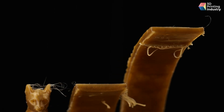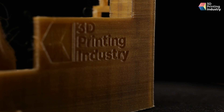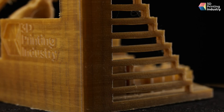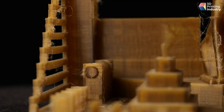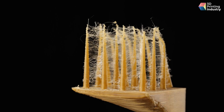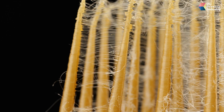You can also read the detailed results in our review article at 3dprintingindustry.com — see the link in the description. The overhang portion of the test is designed to determine the angles at which the system is able to print without the use of support structures. The Funmat managed a maximum overhang angle of 50 degrees without any problems, which is fantastic for a material as difficult to print as PEEK. The bridging test evaluates a system's ability to 3D print horizontally over a void. While the Funmat only managed to print up to a bridge length of 20mm before the structure started curving, this is still an impressive result. Finally, the retraction test gives us an idea of the printer's extrusion capabilities. With high-temperature materials like PEEK, it's not unusual for even the best printers to struggle, but the Funmat held its own admirably — the spikes had some significant stringing between them, but the structures were themselves fabricated successfully at the correct heights.